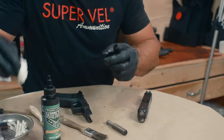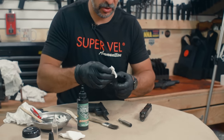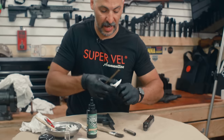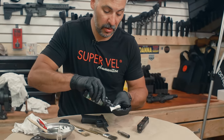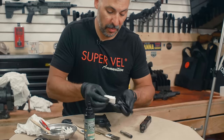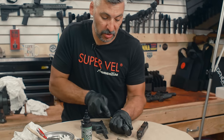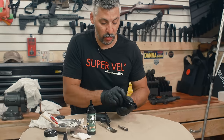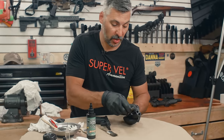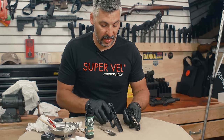One other thing — let's run a couple of lubed patches through the barrel. This is not a storage setting, this is a firing/running-the-gun setting. Use a brass or wood brush so you don't cause any injury. This is pretty clean. If you were going to store the gun, you'd want to run it till clean and put a little oil in there.